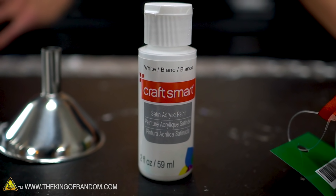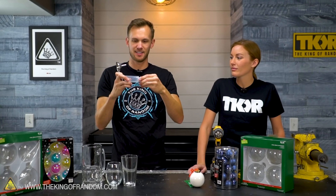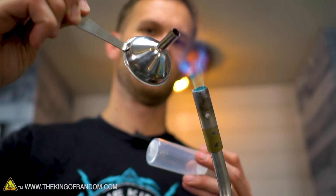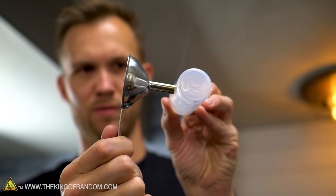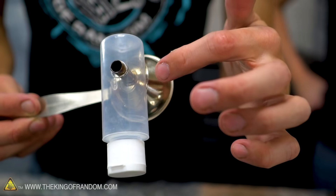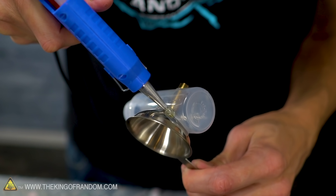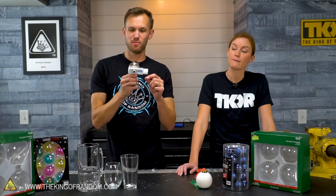Kali has been cleaning up a paint bottle, and that's what we're going to use. Here's my plan: we want our funnel to be pushed into the bottle so it's in the middle. That way we'll be able to take the cap off, add sand, and tip it back and forth to add more or less sand, getting close to the opening depending on how much is in the bottle. The best way to get this in here is going to be to just melt our way through — we're going to heat up our funnel with a blowtorch and melt through one side. We can see it's melted on quite nicely; it's securing itself in place with all of the melted plastic. Then we're going to take a hot glue gun and fill in all of the gaps for a stronger seal. We now have a chamber with a funnel running through it.